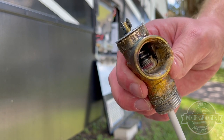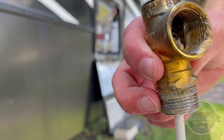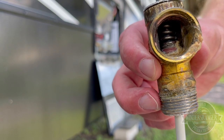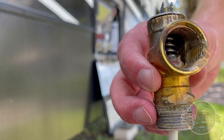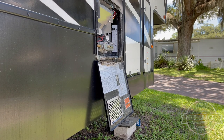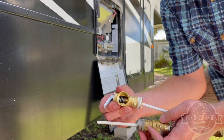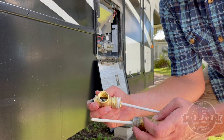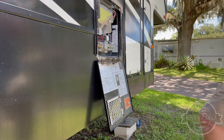Here's the old one. You can see the scale down inside there where the spring is — below the spring and the threads. That's why it's leaking. That thing popped open at some point, got some scale stuck in there, started dripping, and then the calcium in the hard water just kind of filled in that extra void and made the problem worse. Got the new one here — make sure we've got the right one just in case. We've matched up the tag on top of there but it's always a chance it was packaged wrong or labeled wrong. Yeah, it looks pretty close, same stem and everything.